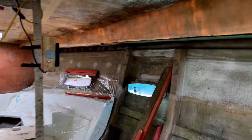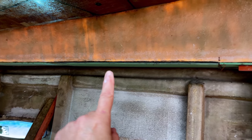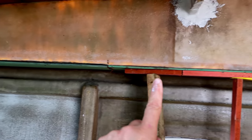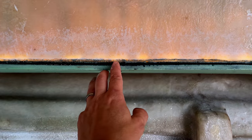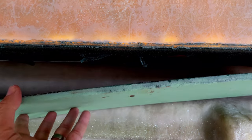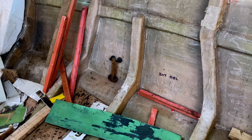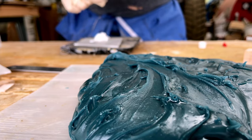Back on the boat this morning. So last time we came in and replaced our old balsa core with these foam core panels, but unfortunately we've had a bit of a problem. This panel here, the bonding paste hasn't gone off. You can see inside here the bonding paste actually didn't go off, and we've discovered that our scales that we were using, unfortunately, were broken and inaccurate.